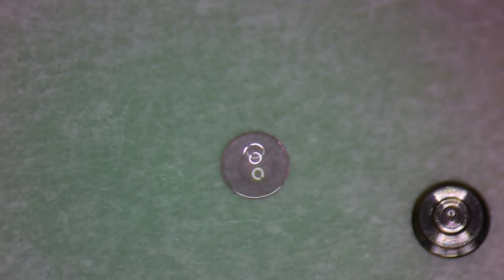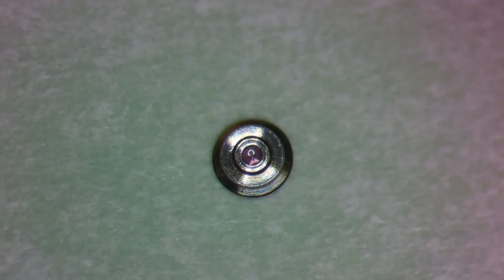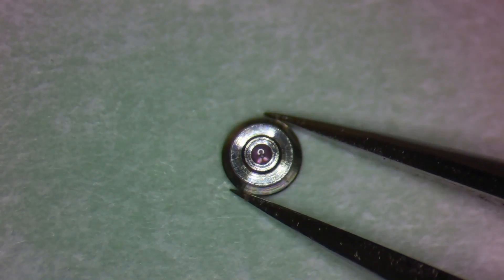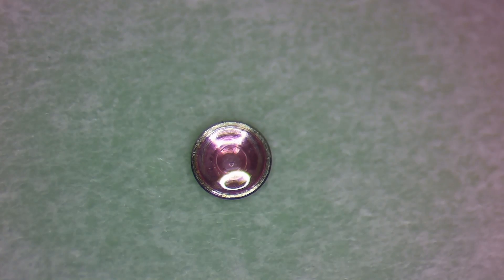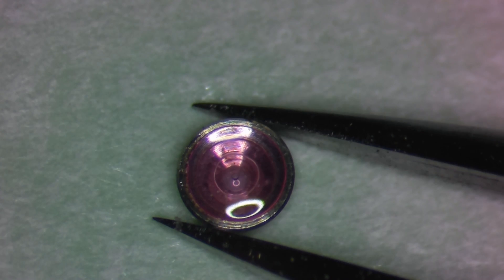When the châton is laid on top of the endstone, this bead of oil on the jewel allows the châton, when it touches the bead, to stick together. With the two pieces now assembled, we can inspect our oil spot through the endstone and see that we have a perfect circle of oil in the middle of the jewel. That's going to be it for today's video. If you have any questions or comments, please drop them below — I'd love to hear them and I'll answer as many as I can. And because there's so much more to learn, I'll see you in the next video.